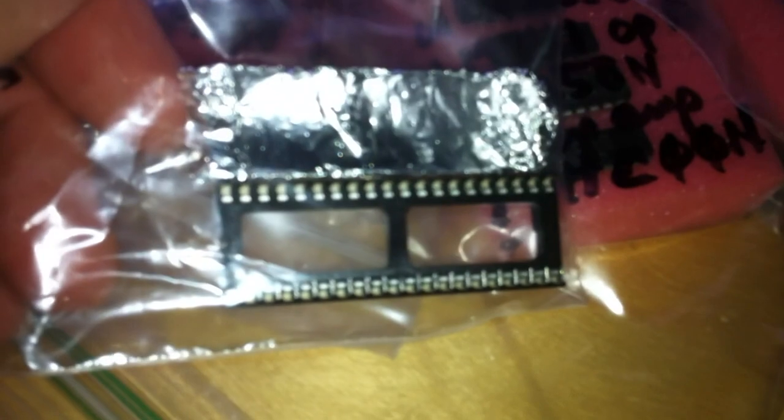These are all the integrated circuits. I wish they had shipped them with foam because some of the pins were bent. I've got each one in its own little protective deal. The thing I don't like is that it worries me when you have static-sensitive devices — they wrapped them up in foil. That really should have been in static-sensitive foam, and I can't open it until I get a grounded workstation set up. And here's the microprocessor, also wrapped up in foil. It's a 40-pin microprocessor, so I'm just going to leave it like that until I get a grounded workstation.